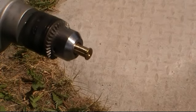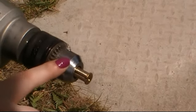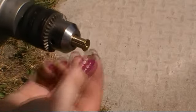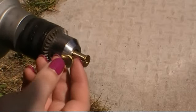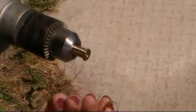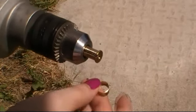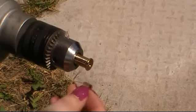You can't really check as you're going without disrupting the one guide. So that's not the best. But here's what I do. I've got a random piece of tubing. This is actually the other diameter of tube, but this one's the diameter for a Schlage, but that doesn't matter. The thing about this tubing is that they're the same depth. So this is my depth guide.